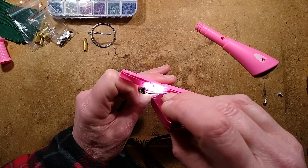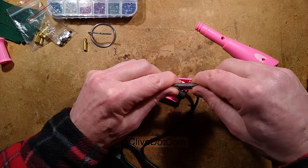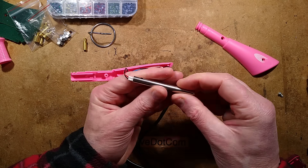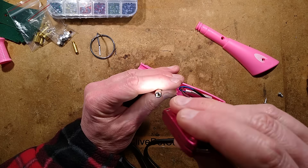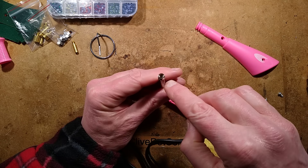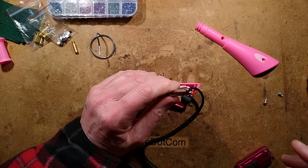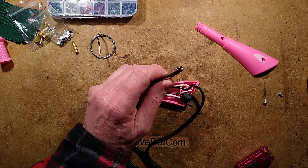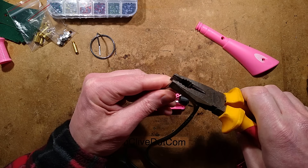It's just stuffed right up at the tip. That's kind of pressed in — I don't think this is going to come off any further. They've basically got the heating element just stuffed in there. Looking down the threaded section I can actually see inside, and it does look as though the heating element is just pushed right into the end. I shall use pliers — if it doesn't come out it's going to end up destructive. I think we can more or less guess what's in it — it's like a mini hot melt glue gun heater, which is the ceramic PTC heater.